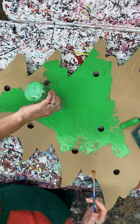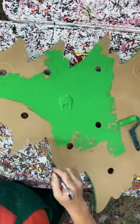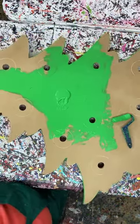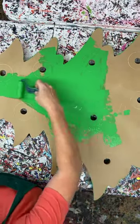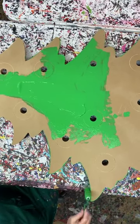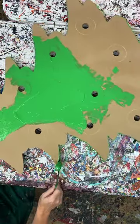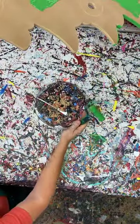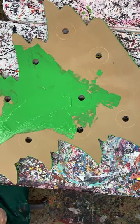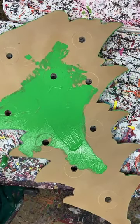Now I will put - because I've got such a big area - I'll use this mop brush. This roller is not going to reach up in the recesses right here, so I will use that mop brush to go into those inside corners. Then I grab the roller and paint some more. You always want to paint your edges - that's very important, not just for aesthetics but to help keep moisture out and for longevity. So I'm going to roller this all the way around. I always use one of these little lazy Susans - you can get the lazy Susan metal piece at any store like a Home Depot.